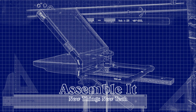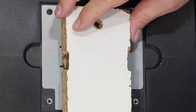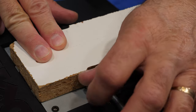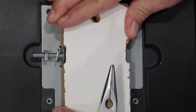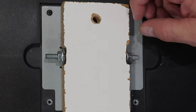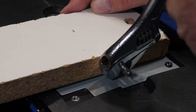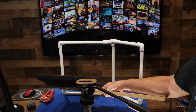Alright, so now we have the frame built out and the support board created to which everything will mount. First, I'll mount the support board to the monitor. This is a cheap VGA 15-inch monitor picked up from Goodwill for less than $5. I took apart the monitor stand and I am just using the mounting bracket. This fits snugly around the wood. Using a 1/4-inch screw that I cut to 4 inches, 2 washers and a bolt lock the monitor to the wood.